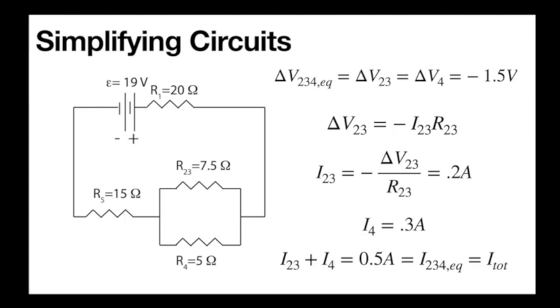Sometimes one is easier, sometimes the other. Sometimes you'll look at a circuit and it's not at all clear how to combine it into R_eq. And so if you find yourself stuck and don't know how to simplify, just tell yourself that you know the loop rule, and so do that instead. Find some loop that you can make, write it out, make sure your currents are different where they need to be, and see what you can solve. So when stuck, you could just try the other method.